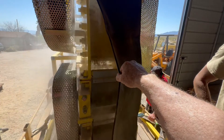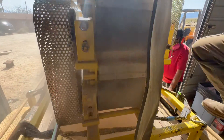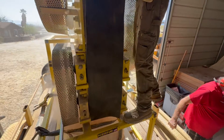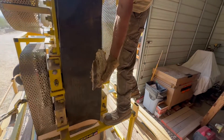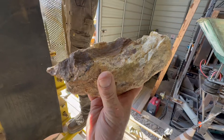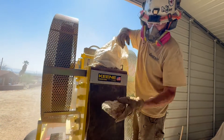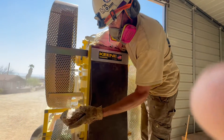You can see the machine's working good here. The top jaw is crushing it down to about maybe 16th to eighth of an inch. The first roller takes it down to about 30 to 60 mesh, and the second roller takes it down to about 80 to 120 mesh. But look how dense and heavy this rock — you can see the agate layers. Believe it or not, you're looking at about a 35-pound rock. I couldn't believe how heavy these things were. But the machine just worked flawlessly the whole time.